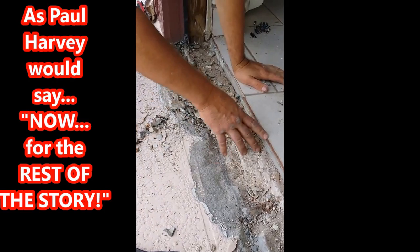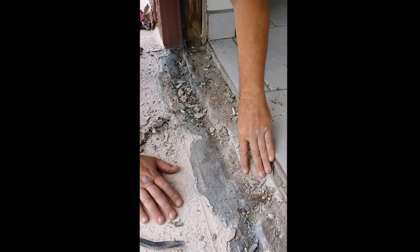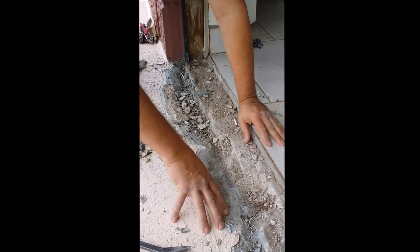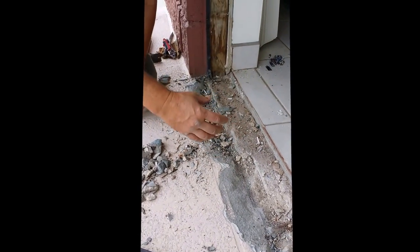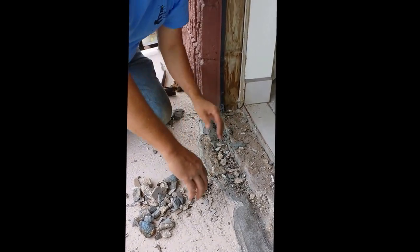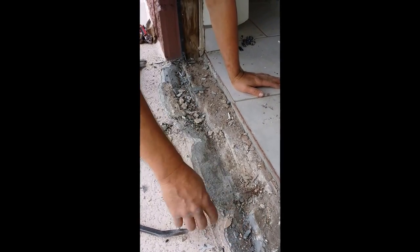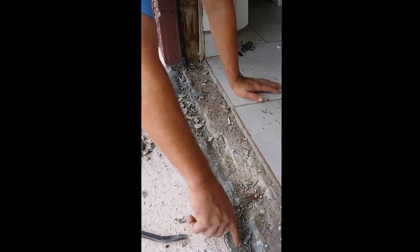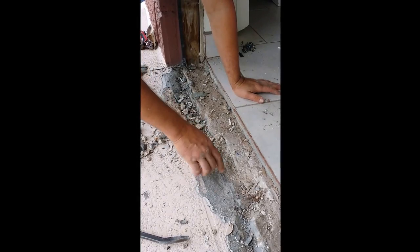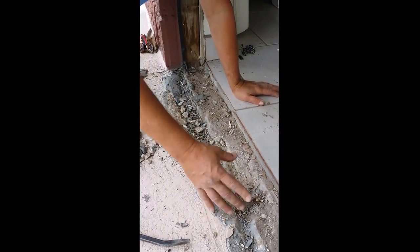Zooming in reveals the whole story. These are two slabs done in two separate pours. This is the original building slab. When they do it this way, they have rebar come out with end loops — a new piece of rebar goes through the old loops to tie it all together and then they pour. Because this joint was never sealed, the rebar rusted and spalled.